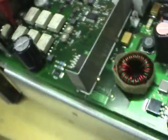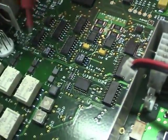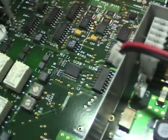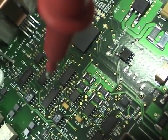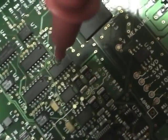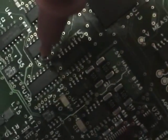And I don't know if I can hold the camera while doing this, but you sweep it across all the places you want to see where it's connected, and the fast continuity beeper will beep when you run it over it. Let's see if I can demonstrate this. Okay, let's see how probe cam works. I've already figured out where it goes, so I'll just go. It was on this chip. If you just sweep it across, and there we go. It finds where it is.